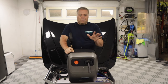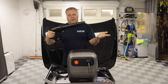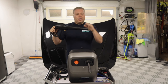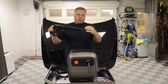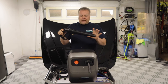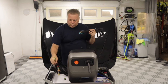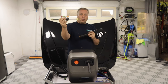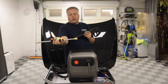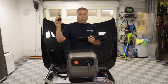First, the gun — I'm not a big fan of these, but this one does have an M22 14-millimeter fitting and an M22 here, which means it's adaptable and not proprietary. These are very common connections. It comes with a wand and four nozzle tips: red, green, white, and orange — your zero degree, 25 degree, 40 degree, and 15 degree. These are 1.9 orifices.